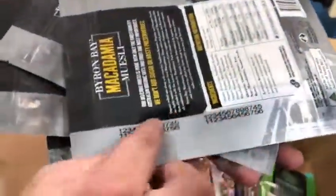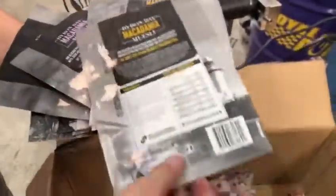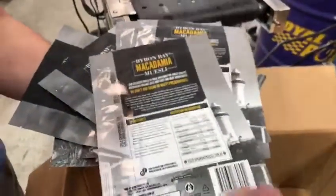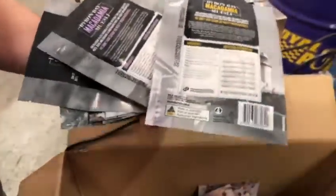As mentioned, we will get some double prints from time to time due to the photocell sensitivity, which we'll need to adjust from bag to bag. The vacuum will also help because it will actually suck the bag down onto the conveyor — if the bag is slightly up or down, it refracts the light differently, which is why we could be experiencing the double print. Otherwise it's the same bag, same color, double print.